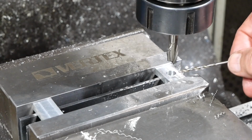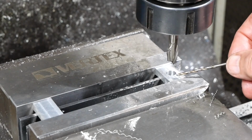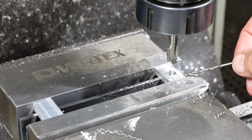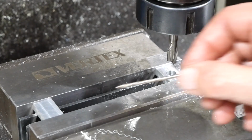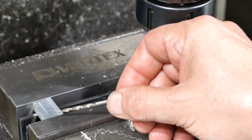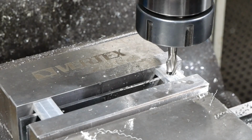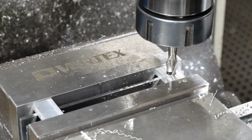And then this one gets 4 holes in it in the corners, same as the one I've just done. And I'll tap these for M3, and this one will just get 4 through holes. Okay, speed somewhere near it. So we want to come down. Oh, I'm all set up for metric here. So what's 31 thou? I'll just do that out. Okay, well, I've just changed the DRO to read in thousandths, so it's easier.